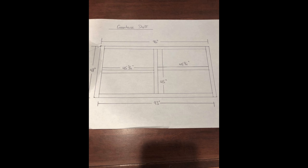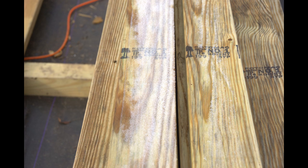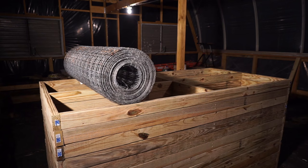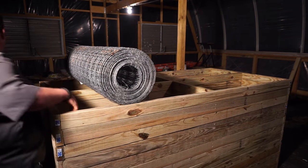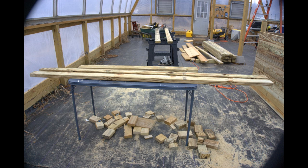We did a four-foot by eight-foot shelf. For the framing of our shelves we used eight-foot pressure-treated two-by-fours. To make our frame connections we use number nine, three-and-a-quarter-inch star head screws. For the shelf itself we use a welded wire 48-inch high fence on the bottom, rolls of 100 feet. Lastly we use three-quarter-inch galvanized staples to attach the fence to the top of the frame.